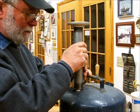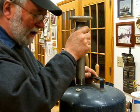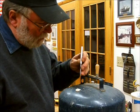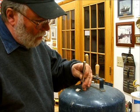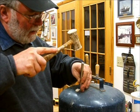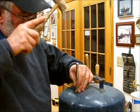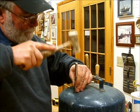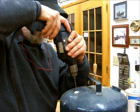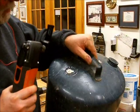I'm going to make this so I can slip this pipe into the can as a slip fit. This will be attached to the box, so when I'm ready to use the box I just lift up the end of the box, slide the can underneath, and slip that in — nice tight fit. Because it's steel and I don't have a steel cutter to do a round hole, I'm going to make a series of eighth inch holes, make little center punch marks that I can drill into, do a little filing, and hopefully it'll fit. I'll use my multi-master saw with a metal blade to cut through between the holes.